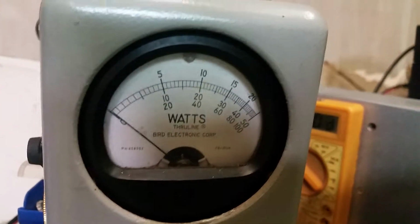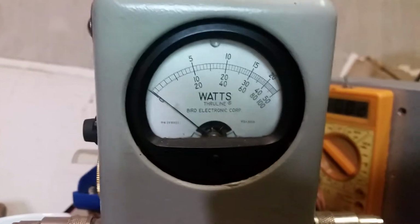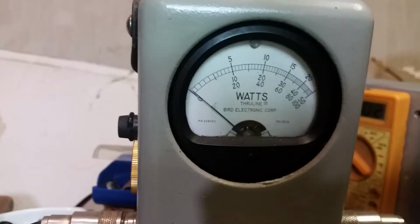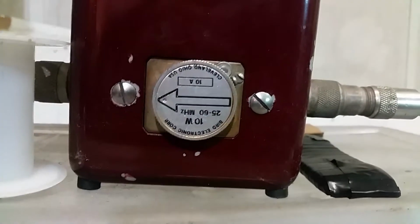All right, RMS. Go. Well, let me turn my radio on first. Getting a little ahead of myself. There we go, got to hear it beep. It's a Cobra 29 Bluetooth. Oh yeah. So that's about 250 watts RMS. All right, here's your input reflect. Virtually flat, almost no movement whatsoever. That's a 10 watt slug. Oh yeah, beautiful. We're just on the medium tap right now, so here's your peak so far.